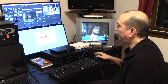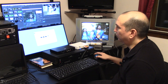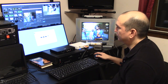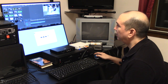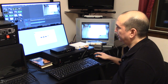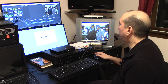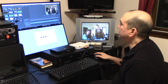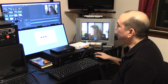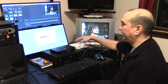Most DV converters can input and output video, so while you're capturing you can see it on one of the old CRT monitors instead of having to squint at a little video capture utility. Some of you may not need that functionality, but if you're going to capture at least five or six tapes, it might be worth it to see it on the bigger monitor and decide which parts of the video you need. You'll get a nice clean image playing VHS tapes back on the old CRT monitor — it'll look better than it will on your computer monitor.